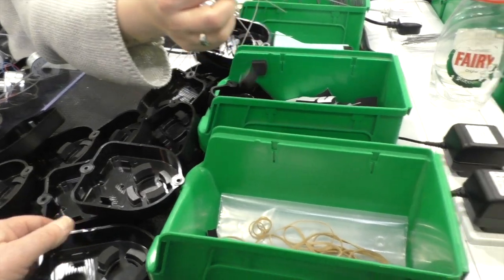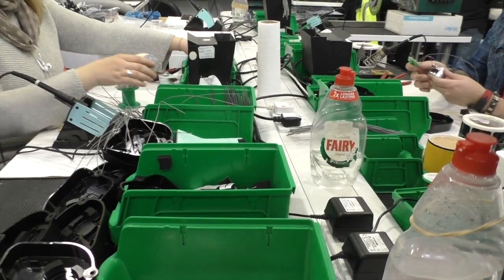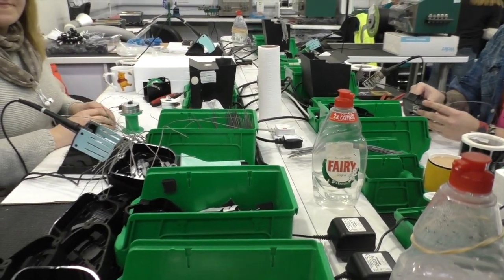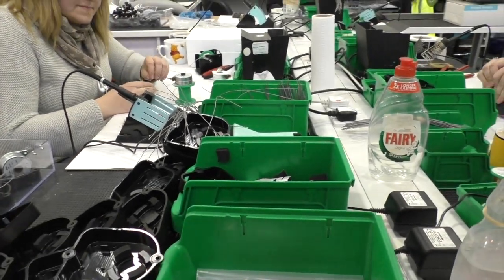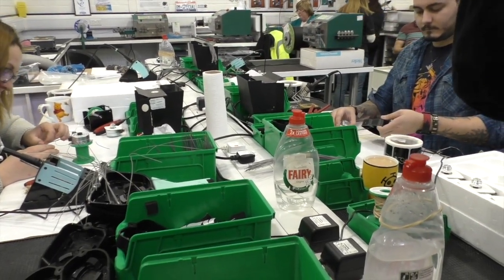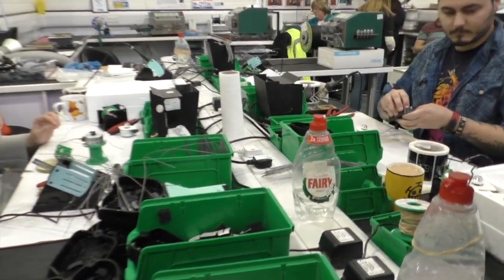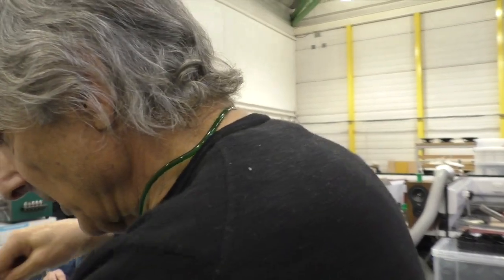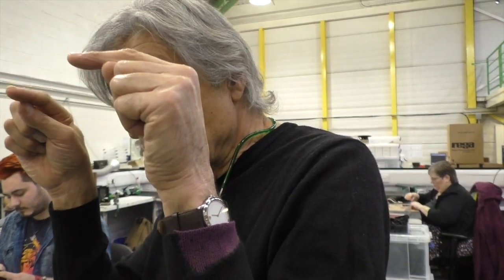When the motor is fixed, we now glue. In the early days, we used to suspend it. I forget the name of the guy in Stereophile. He's talked about motor vibration, etc. We used to suspend the motor to eliminate the vibration from the turntable. But in suspending a motor, you compromise its drive. But as the motor gets better and better, and we develop the power supply, the motor drive gets more stable, the vibration drops, and it becomes relevant that you rigidly fix the motor. So we got to that point.